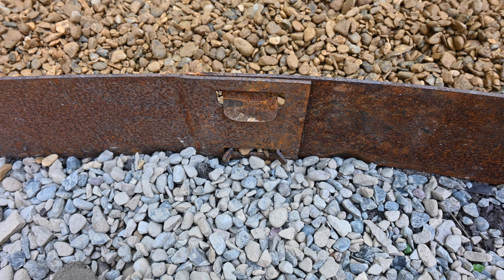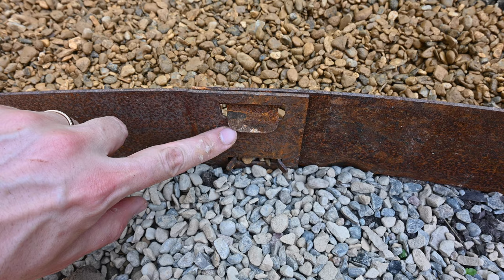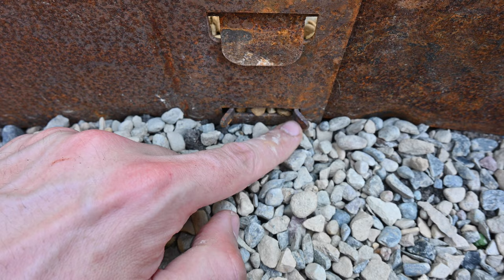Here are two connected pieces on a curve — you can see how it slots in. Looking at the metal tabs, I've bent them round — they were flat in the middle and I've bent them over. Ideally you'd bend them all the way back so they lock both ways to stop movement up and down. Where the ground undulates, I've added extra hardcore in the centre and soil around the outside edges. I've also used supporting pins hammered about 30cm in for extra stability. It's rock hard and really solid — a great product I'll definitely use again.